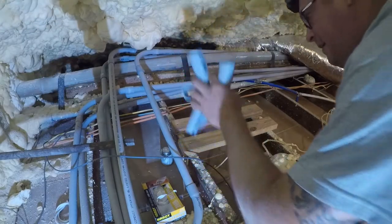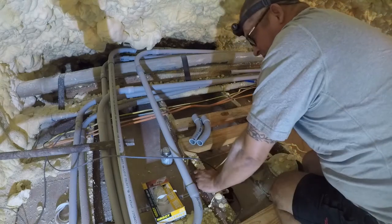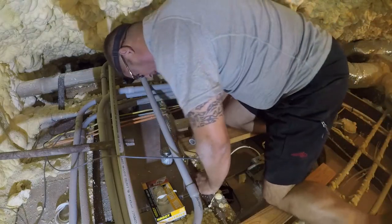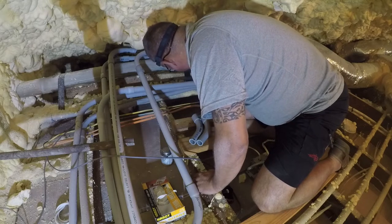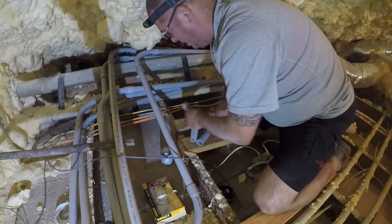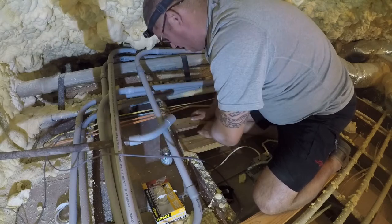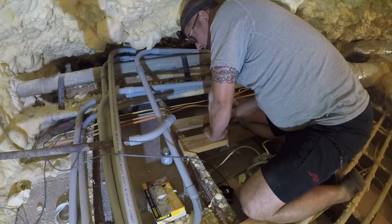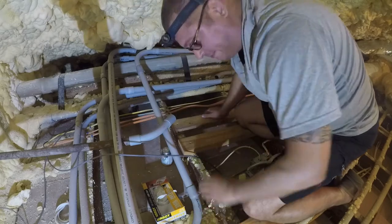I'm back with my 45s. When you're doing conduit, you want to not have more than 360 degrees of turns between your pull access points, so you are far better off to use a 45 wherever you can get away with it. You want to dry fit — which is just simply put stuff together and see how it looks. I don't think I need to do anything other than connect these. It looks like I need a piece that's 28 inches long, so let me go make that.